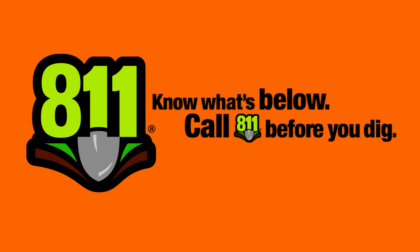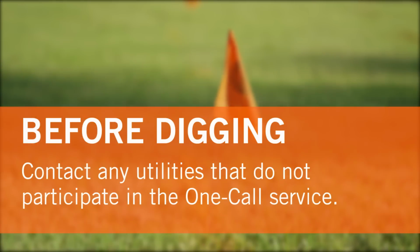Then, contact your local one-call to have underground utilities located before digging. Unless it is an emergency, you must give one-call advance notice to allow time for utilities to be marked. Also, contact any utilities that do not participate in the one-call service.